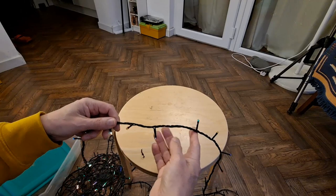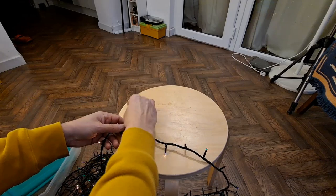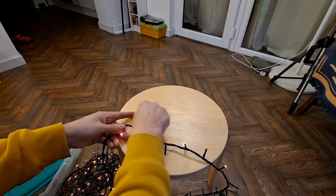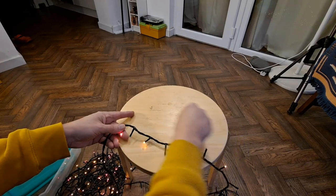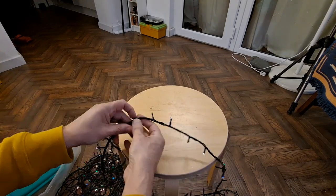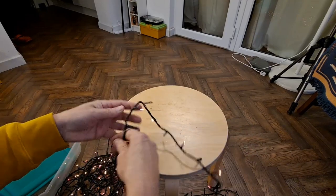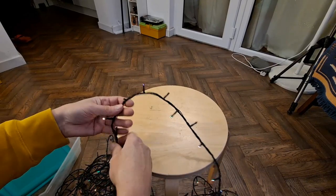I did draw a diagram at one time showing them in different strings. So you've got one string being driven by the current flowing one way, and then another string connected to that, but in reverse. So the other string lights up when the current flows the opposite direction. See, all of these are okay. There's some more dead ones right back at the other end.